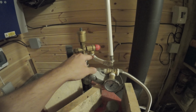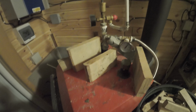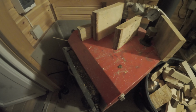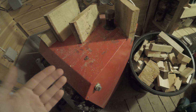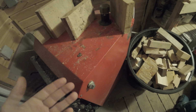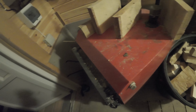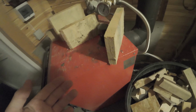If the pressure is above 3 atmospheres or something, it blows out the excess pressure. So anyway, if this starts boiling, the steam will go outside from the top. I made it go to the top of the roof, so it doesn't explode. So that will mean that if you have a 30 kilowatt stove, you can many times overheat it just by accident if you always put it full. So I would recommend some 20 kilowatt stove. That would be my recommendation for 1,000 liters of accumulation.